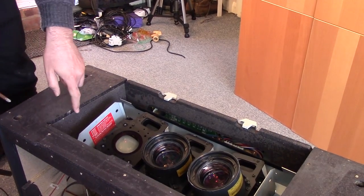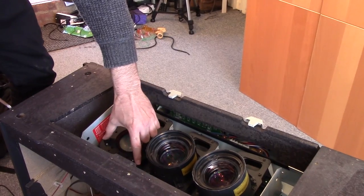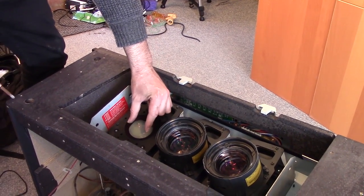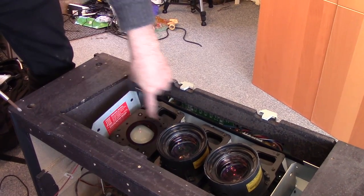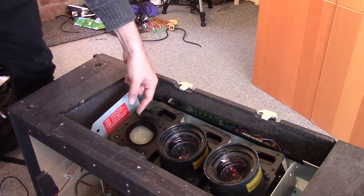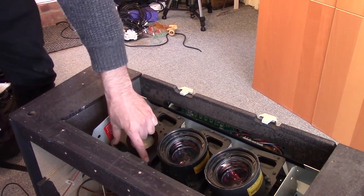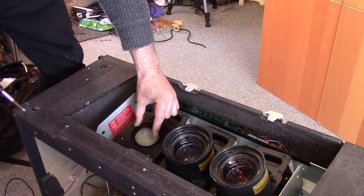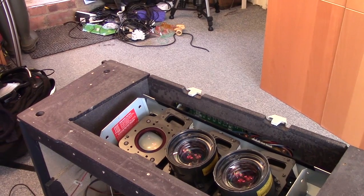I think I understand what they're doing now. So they've got the CRT underneath this convex lens, concave lens will actually be bigger, and they're using the concave lens to focus it down to something smaller, and then the convex lens, because otherwise they'd need a huge lens for the size of the CRT. And if they make the CRT too small, then they'll have problems with not enough brightness from the phosphor. So they've used what looks like a 4-inch tube behind there, I suspect. And then they focus it down with this concave lens to something smaller, and then the convex lens up to the full size to keep the optics small enough.